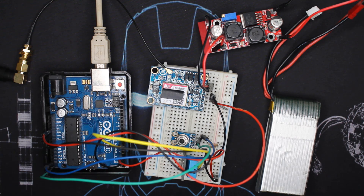When you use this module in a project, you want to communicate with your device using your phone, especially via SMS, and you need a trigger to tell your device to send you that SMS. Before we used a push button, but using this module means you have to put the device in a remote area. For those cases you can either make a threshold for which the device will send you an SMS, add an RTC module and send SMS periodically, or as we'll see today, request that information via SMS.